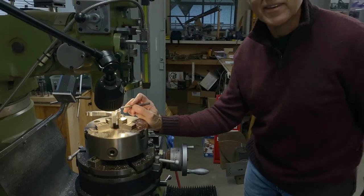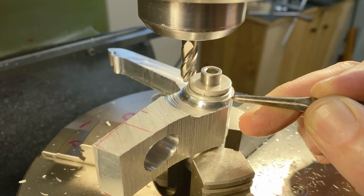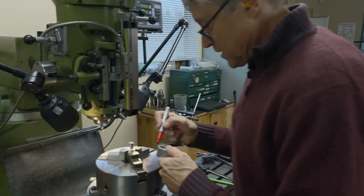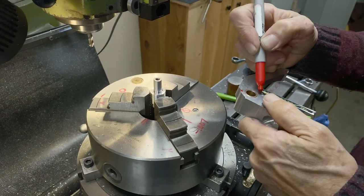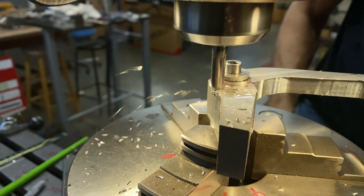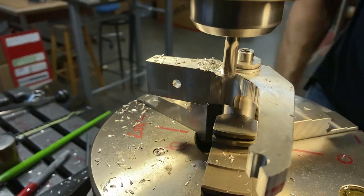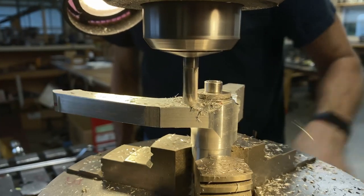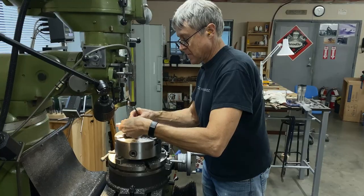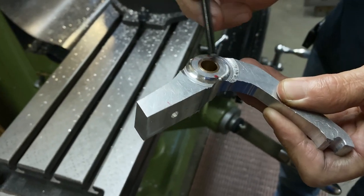Can you see how this radius matches that? The line on the top is continuous — there's no step. That's what I was hoping to get. On this one I'm going to go from here to here, go around like that. So that's what it looks like — we've milled around the boss, we've got a nice circle.